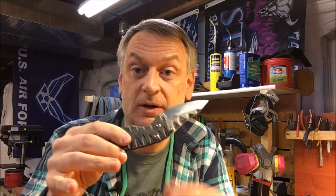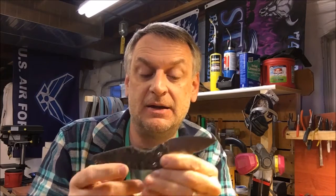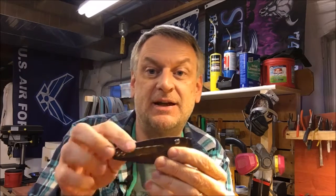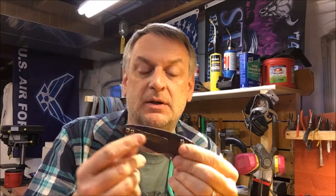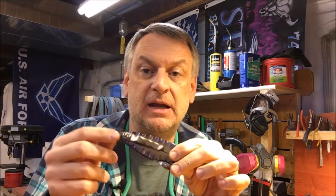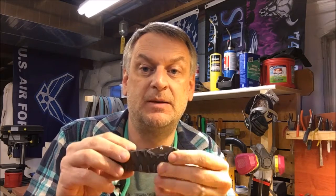And then when the blade is totally done, I make the handles around the blade. So I take the blade and lay it down onto the titanium and trace it. And it's like, okay, the pivot's going to go over here, and I need to have enough space to clear. When I close it, I've got to have enough space for a backspacer. I have to have it be deep enough to not have the blade sticking out and all that. So the line has to kind of follow the blade. You don't want to have a swoop here and have some weird looking shape out here. So it's kind of like form follows function. I end up tracing out the blade shape and designing the handles to encase the blade and leave space for the backspacer, the pivot, and so forth, and then put a finger cutout in here and all that. So that's how I design the knife.